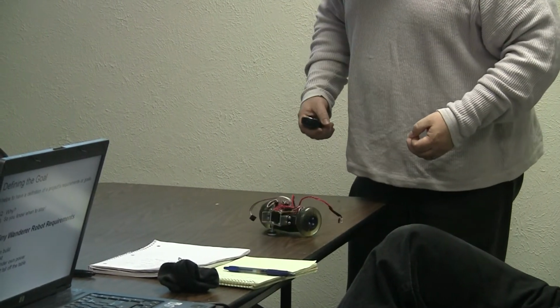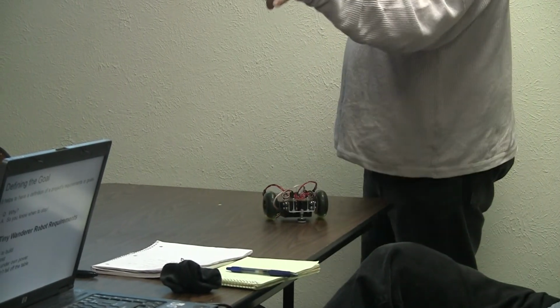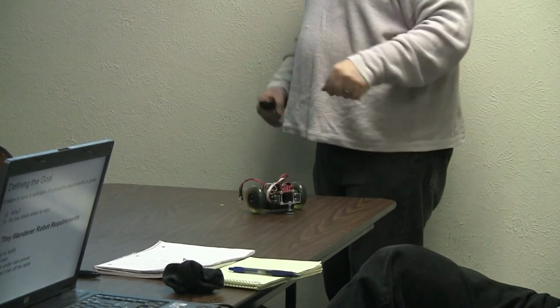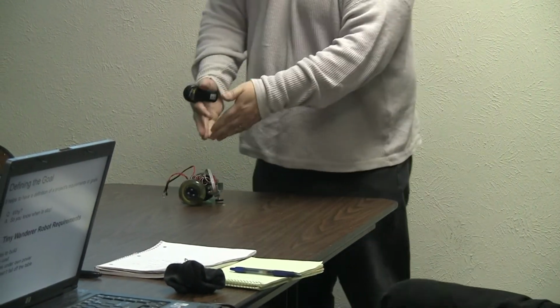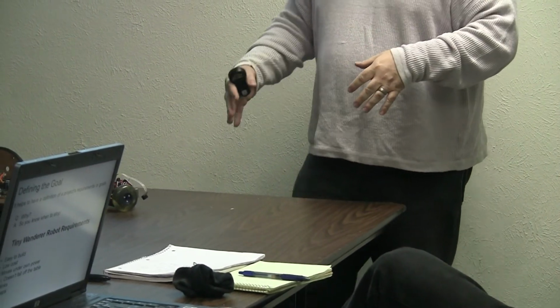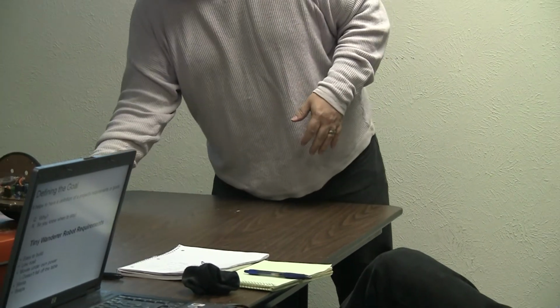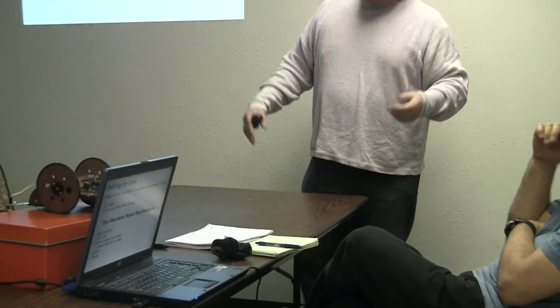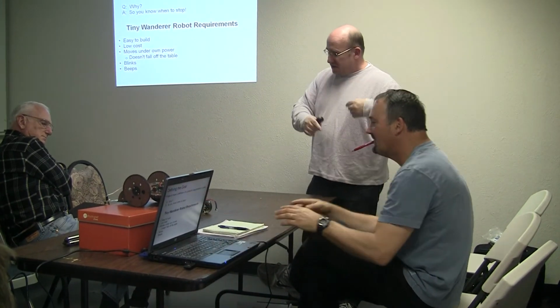And see, it just detects that, backs up, turns a little bit, and continues on. Now, you saw that robot drive in a straight line using two servos that were mounted opposite of each other. This is the same thing, but because I'm using a different algorithm to drive the servos, not as good, without the same kind of resolution, they don't go the same speed, so the robot doesn't go in a straight line. One's going forwards, one's going backwards, as far as it's concerned.